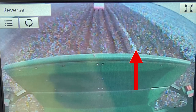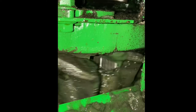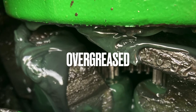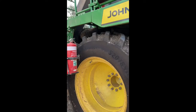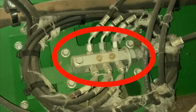That white stripe is something I'm always watching for on my rear-facing camera. I don't know if this is the only machine that had this, but at the start of the season the machine I was driving — when I would grease the heads — the slowest head took a full 60 seconds more greasing time than the fastest ones. That forced me to over-grease all the other heads on the machine to get that slowest one properly greased. I searched high and low, and eventually the last thing I checked was the nipples in the six-way picker grease manifold under the cap. They had significant amounts of silicone on them — particularly that slowest one was almost completely blocked. So if your greasing is not really even, it would be worth checking these.